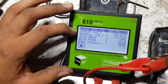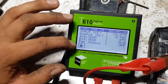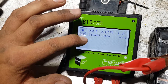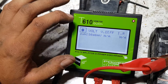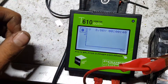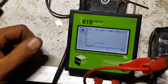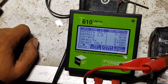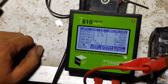There's a data section which shows you the input voltage again so you can see if your power source is struggling, the output voltage, internal temperature, and it'll tell you if the fan is on — you'll hear it. It didn't check internal resistance because it started charging straight away. We've got 3.8 volts — or 3,851 millivolts — whatever floats your boat. It'll even give you a time-versus-charge-level graph, which is useful for testing curves. It's pretty cool — it'll just tick away pushing 2.22 amps into this battery until it reaches 4.2 volts, then shuts off safely.